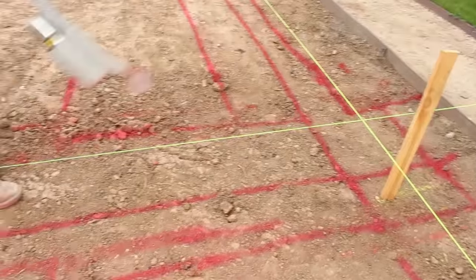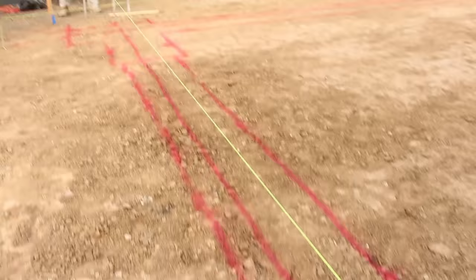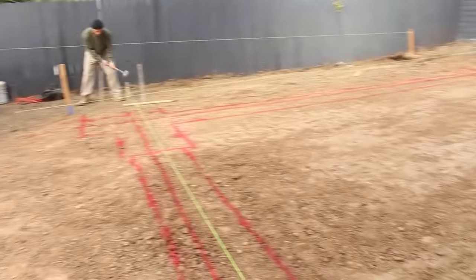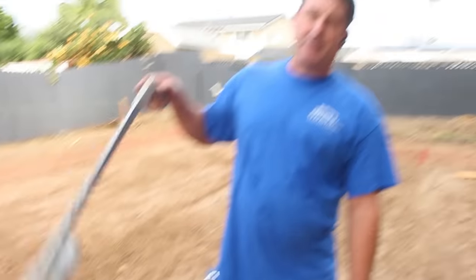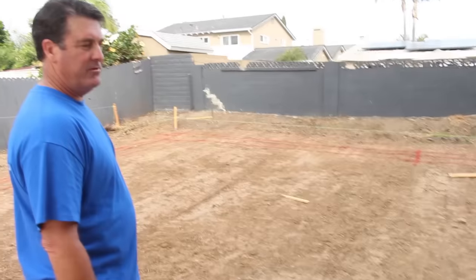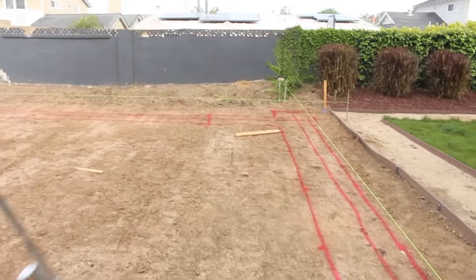That's for your shear walls, and this is on either end of your opening. This is a drive-through garage, so there'll be an opening for the garage door on both ends — just for ventilation purposes, really. You won't have to run AC or anything. You get a nice breeze because we're real close to the ocean. We've got a two-foot-wide footing through the middle.